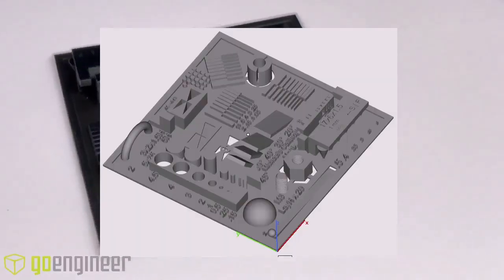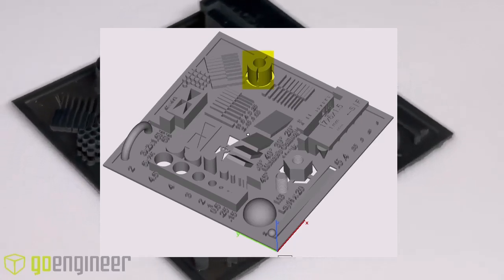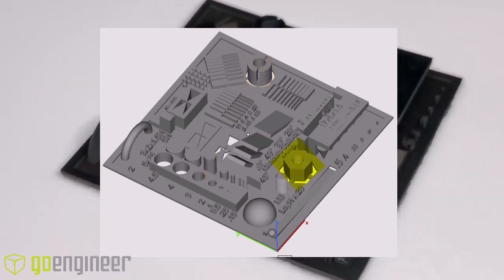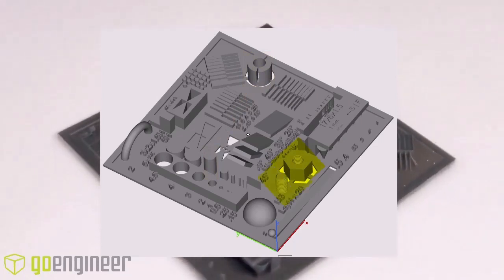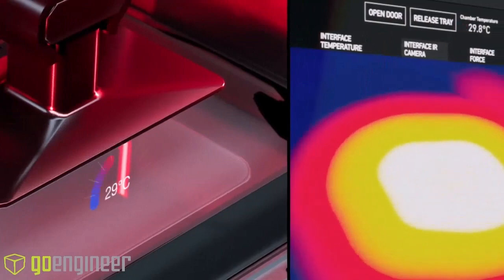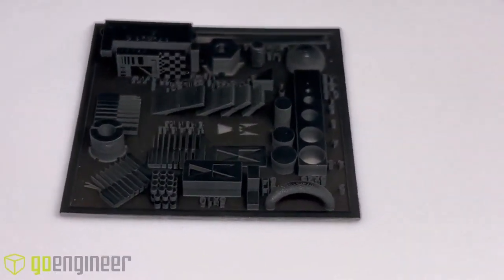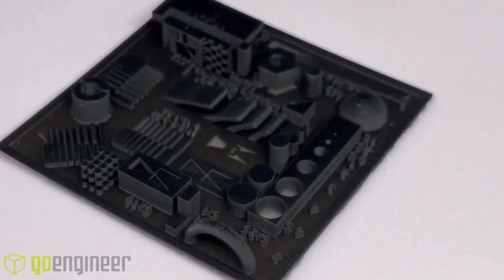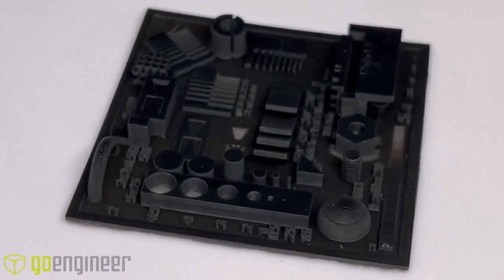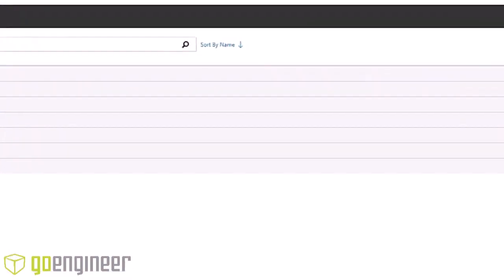The model also contains two nifty breakout parts, a 3mm internal diameter tube that fits onto a protruding 3mm cylinder, and an M3 nut, which may fit the M3 screw next to it, depending on how well you have your printer's resolution and exposure dialed in. All of these print evaluation features packed into a quick printing and low material utilization package make this a superb tool for exposure calibration. You will also need to have an OpenAM license for your Origin One.